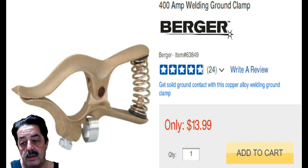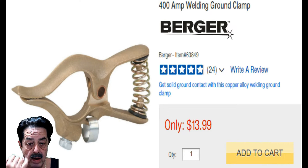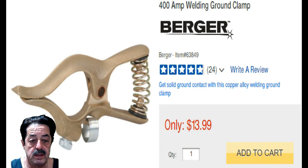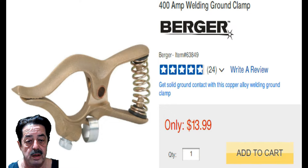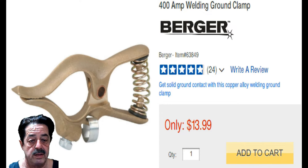Here's a quick story: I went with a friend to look at a used Miller welder a guy was selling because he'd upgraded. We hooked it up and played around with it. I whispered to my friend that if he gets a really good bargain, take it. What the seller didn't realize was that the grounding clamp was all frayed and funky looking. We bought it, replaced the grounding clamp, and it made a huge difference. Most MIG welders come with a jumper-cable style clamp — they're not the best, and it's strange that manufacturers put cheap grounding clamps on otherwise fantastic welders.